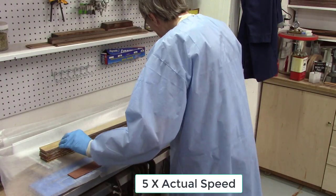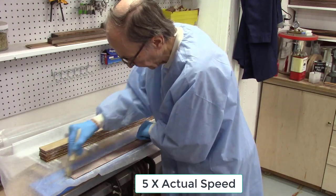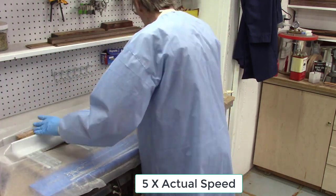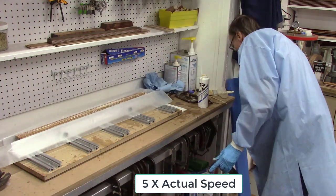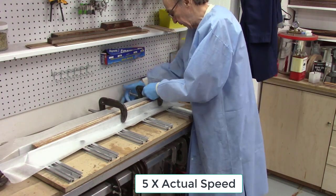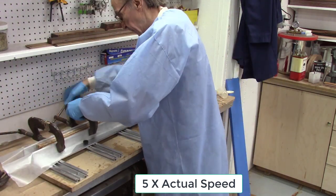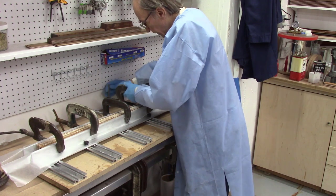To produce a multi-layer laminate board for the herringbone and rope design center inlay strips, I need to glue together the thin wood strips that were just sliced on the AccuSlice system. The wood strips are arranged in the desired pattern and glued together using the glue jig system. Titebond 3 glue was applied to both sides of the wood strips, then placed into the glue jig between two aluminum angle irons and clamped together with C-clamps to squeeze out the excess glue. After allowing to dry for at least four hours, the glued-up boards were cleaned up on the jointer planer and edge sander to prepare the laminate board for slicing at 45 degrees.